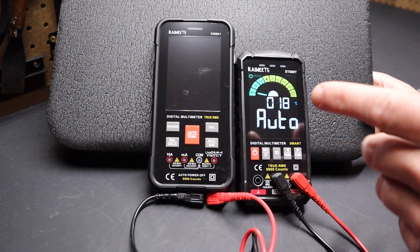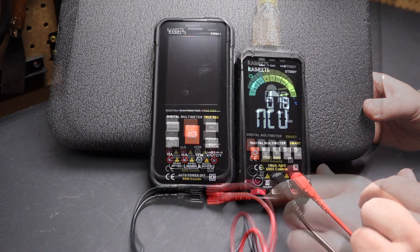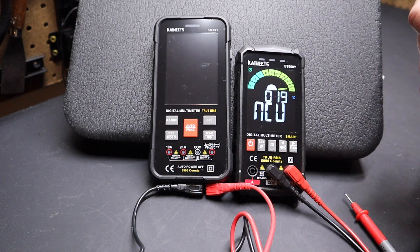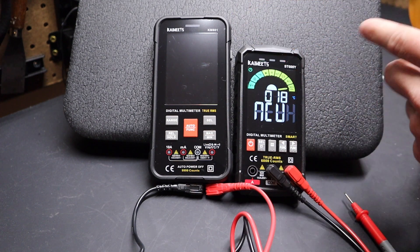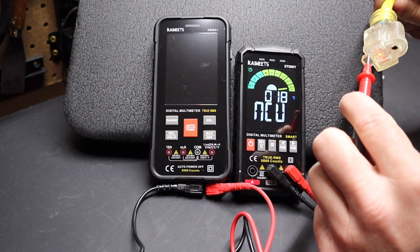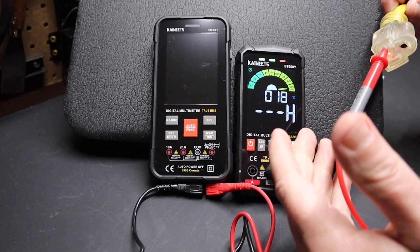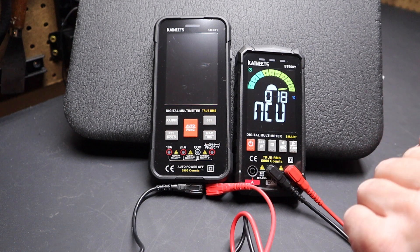The last thing I really like about these is they both have a non-contact voltage tester on the far right. It gives an 'L' and beeps slowly with one green light at the top on the ST600Y Kaiweets meter, but as I slide it over to detect more voltage the beeps become more rapid, and on the high voltage wire it shows 'H' with two green lights and a red at the top. What I really like and think makes it unique is you can do what's called a live test — just take the positive lead, no negative lead needed, plug it in and it beeps. This is excellent if you're trying to find a breaker — you can plug this into a receptacle, flip breakers, and find which one you need without an additional piece of equipment.